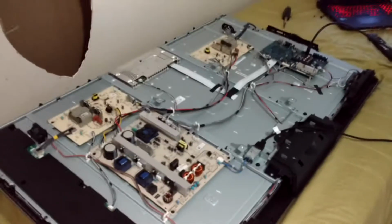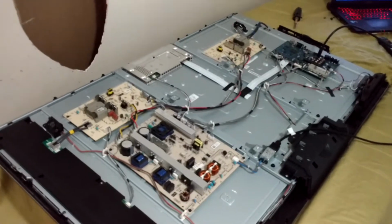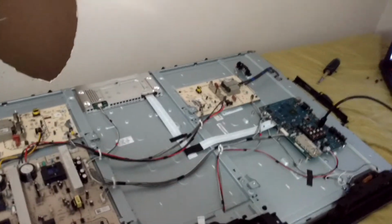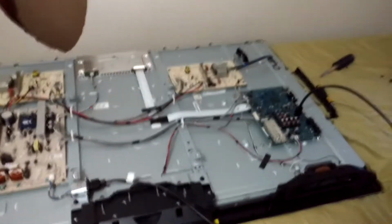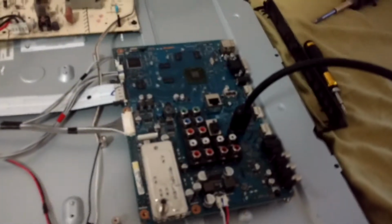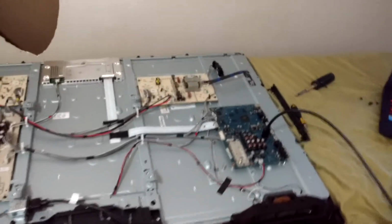That actually worked. This is the video that just shows the main board replacement. I thought I was gonna do component level repair, but yeah. Hot air on either the GPU right there, or that smaller thing right there. Fix that. I don't know if it'll stay fixed, but holy shit, it's actually got a picture on it now. So yeah, that might just be it. So then if I fix it and put a heatsink on, I should turn it off because that's gonna overheat.